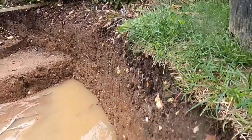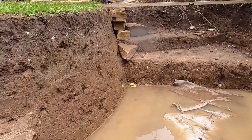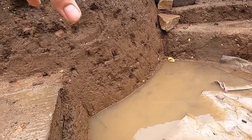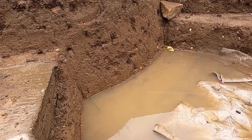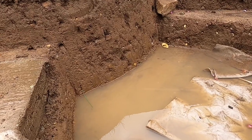In this pond, I'm going to be doing stonework right from the base of the pond to the sides, to the edges of the pond. So I've got a lot more stonework, a lot more height of walling, and a lot more weight bearing down on the ground beneath. So I wanted to make sure I had some sort of substantial footing beneath. So it was just a simple trench dug down sort of 10 inches or so and filled with some concrete.